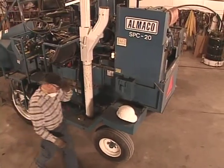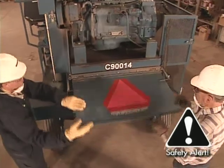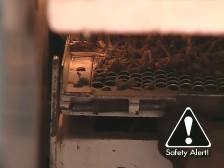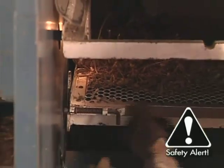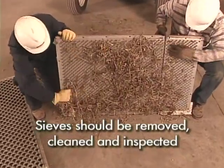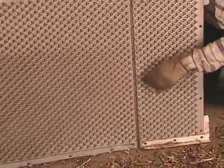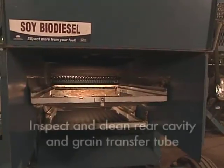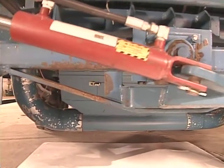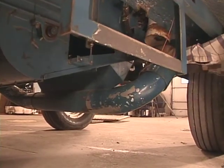Inspect and clean the feeder area in front of the cylinder. There may be an access door to make inspection of this area easier. Moving to the back of the machine, the rear should be easily accessible. There may be a removable rear panel. Sieves should be removed and wiped clear of residue. The rear cavity behind the cylinder and the grain transfer tube at the bottom should be inspected while the sieves are out. Check bends and elbows for access panels that can be opened.